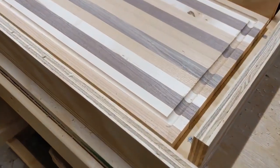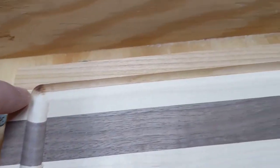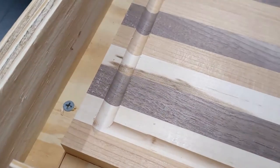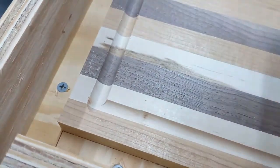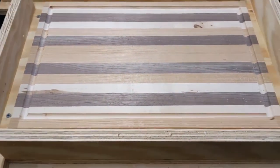Let me show you how that looks in here. Check that groove out — right around, look at those nice corners. There's a touch of tear-out right there but I think we can sand that away nicely. Just a little bit of burning in that corner, otherwise it went right along that edge nicely. We got just a little off in one spot but it's so minimal — if I just give that a little sanding, we'll take that bump out and be set. There's the overall picture of that cutting board. I still have to round over some things and sand it — this cutting board's got a ways to go — but that is our juice groove jig.